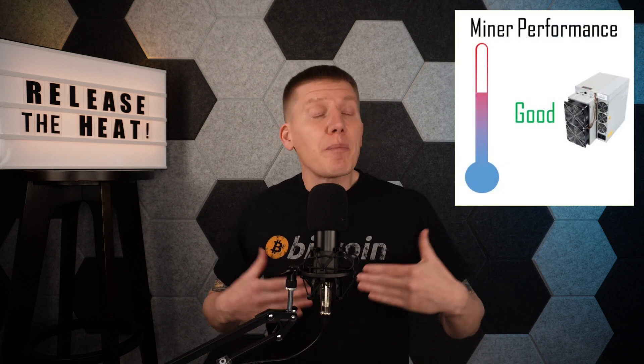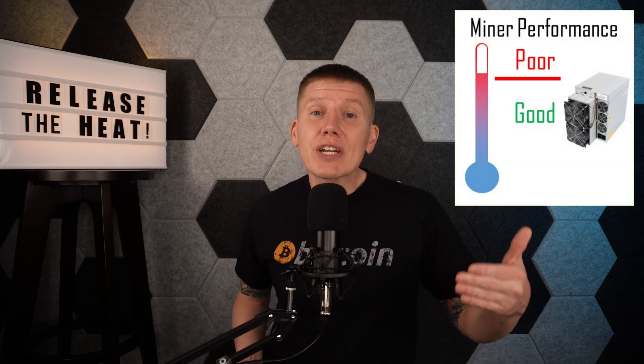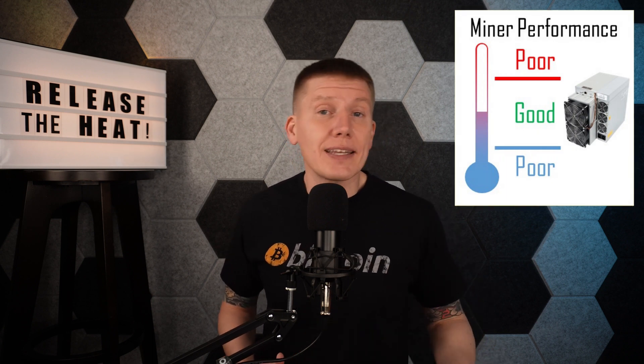One of the challenges of running a dry cooler year-round is cold weather. Many of us live in areas where the ambient temperature can get very cold, sometimes below freezing, during some times of the year — particularly at night. If you run your dry cooler straight through these times, you might overcool your cooling fluid, which in turn will overcool your miner. It's fairly common knowledge that if a miner gets too hot its performance will suffer, but if a miner gets too cold, this isn't too great either. At temperatures significantly below room temperature, miner performance also will degrade, impacting how much hash power your miners will provide to the network.